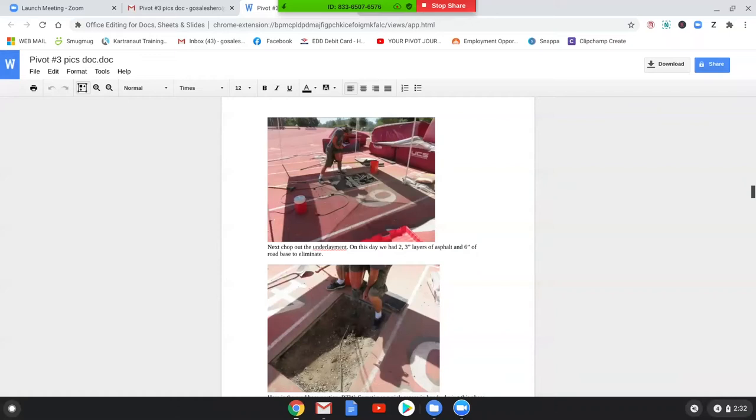In some locations it's important to have a good jackhammer — this is a 90-pound jackhammer, which you can usually rent for $40 or $50 a day. This track had an asphalt subsurface. In the top picture we started chopping the asphalt out. This is why you score the outside edge with the concrete saw — so your sides are nice and straight, as you can see in the bottom picture. Now we're down to the sub-base: most tracks have a three-to-four-inch asphalt or concrete sub-base.